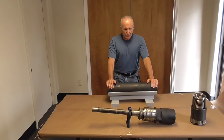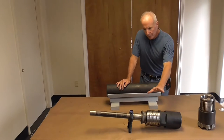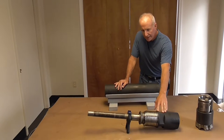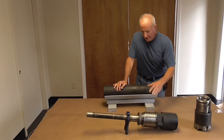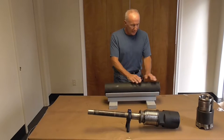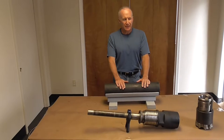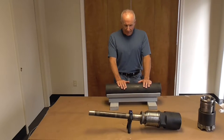We're just about finished with the strip down now. We've got the bit and chuck assembly taken out and went over the back head and collection tube assembly. The only things left in this casing right now are the cylinder, the piston, and the piston retaining ring. Let's go through the process of getting the piston out.